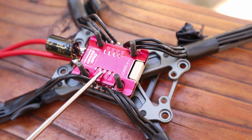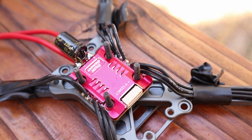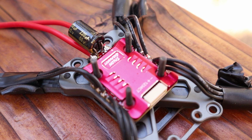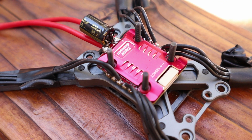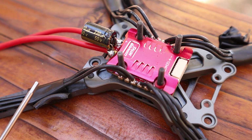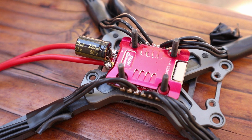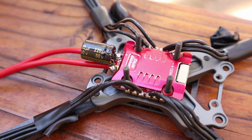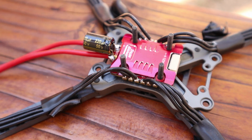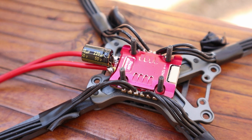On here, I have a Talon Gigawatt ESC by Helination. I actually just posted a video about this, so I'll link it in the description below so you can learn more about that ESC. I'm running a 50 volt 220 microfarad capacitor, which is specifically set up for 6S, although I plan on also running 5S on it. Where on my older setups you would have seen a 35 volt cap, I really recommend you do 50 volt for 6S.